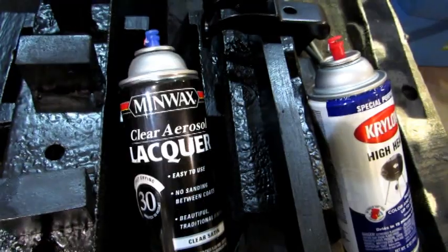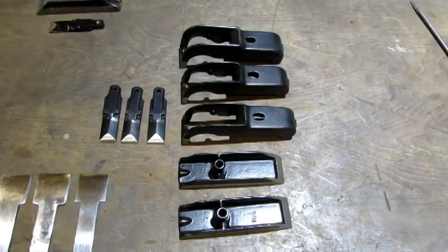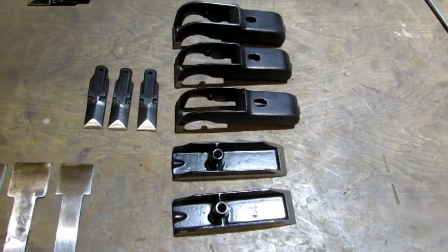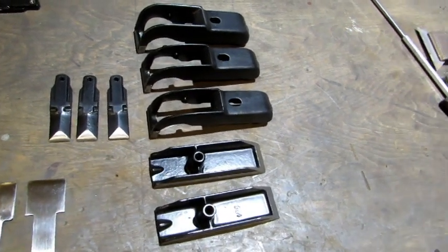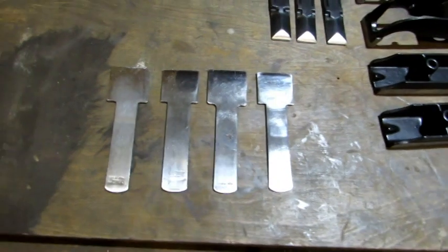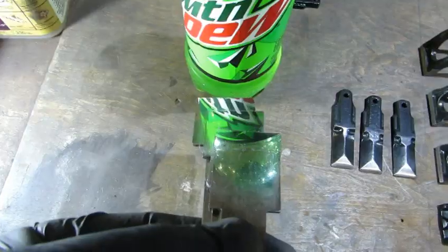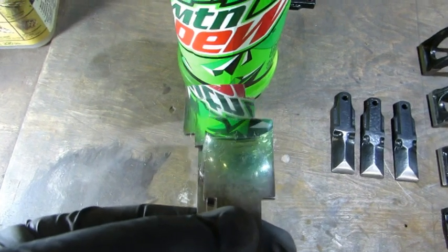Four coats have been applied with the first finish and a final coat with the second finish. The bottoms, tops, and caps that required a new finish are done. I gave them a light sanding with some 3-ought steel wool, and all four irons have a razor edge on them and are ready to go. Here's a closer look at the back side and the business side of the irons.